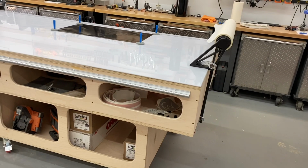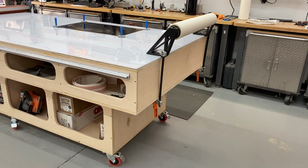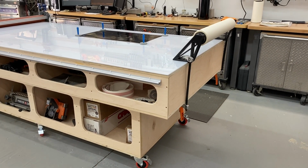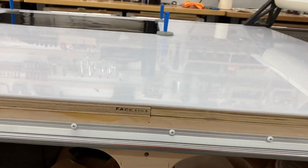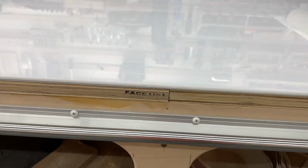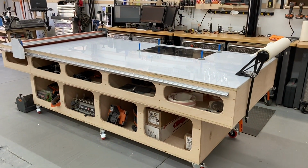And that's really all it is, are boxes. I did the same thing. In this case, I built it 12 inches. All the materials I used were 4 by 8, by the way. So you can see a join right here where a 2 foot piece was joined to an 8 foot piece. So this table overall is 10 foot by 4 foot.